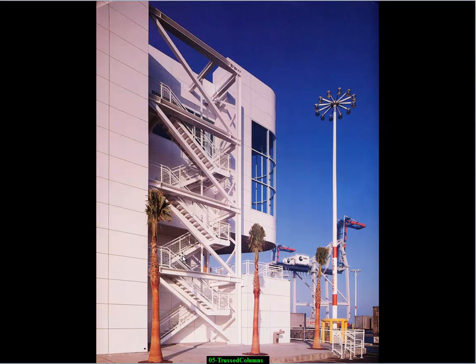bay in this building, and the diagonals have been very well coordinated so that the slope of the diagonal members has exactly the same slope as the stairs. Stairs, of course, are not on 45 degrees. They tend to correspond to a step upward of about 8 inches and a horizontal movement of maybe 11 inches or so. And so you see that manifest in this more gentle than 45 degree slope. But here we have a building that can be thought of as a column, and the bracing of these members is what's allowing these sub-pieces or these individual columns from failing.